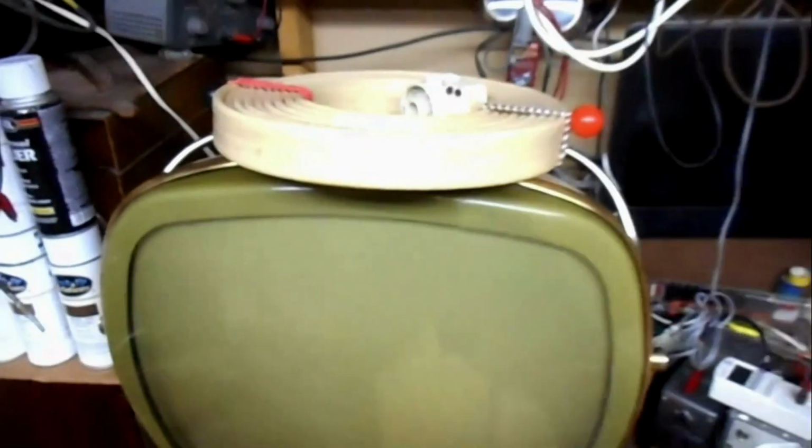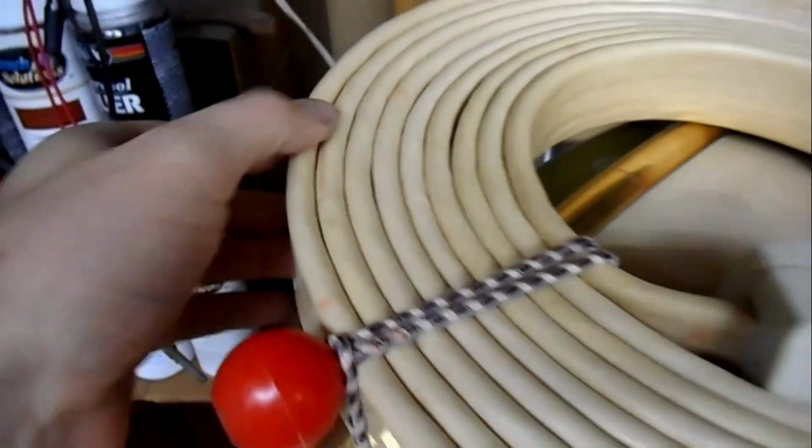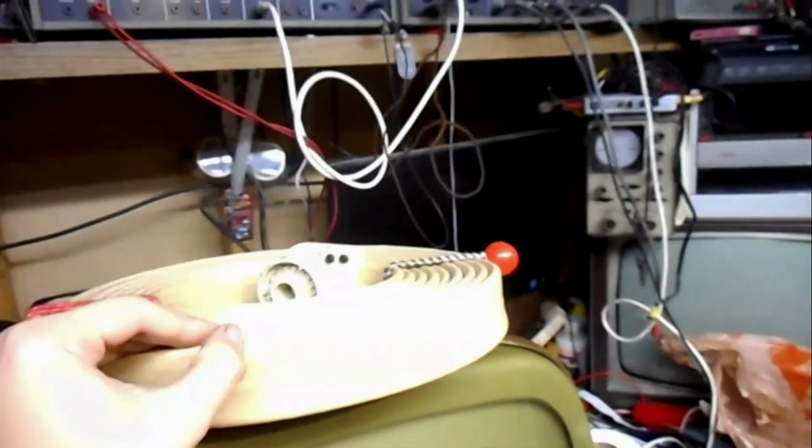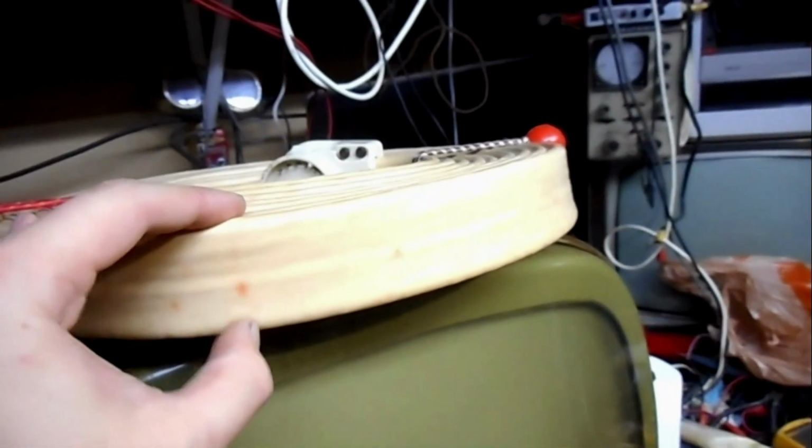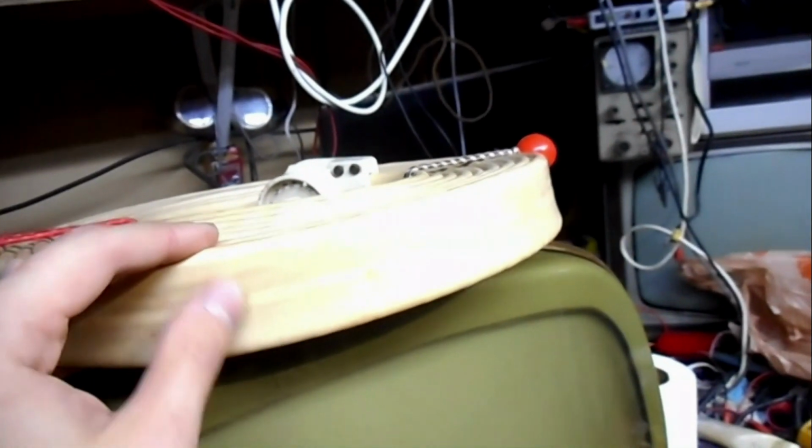Okay, it's the next day and the cable's done. I got it pretty clean. It's not going to be perfect. There's always going to be little scratches and bits of wear on the edges because these cables often got used, put underneath rugs, left in crevices behind bookcases to get dirty for decades, walked on, stepped on. As long as there's no cuts that penetrate through the tan insulation into the colored insulation of the wires underneath, the original cables are still perfectly safe.